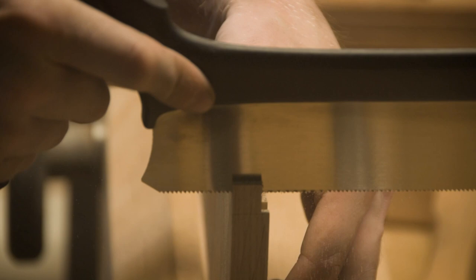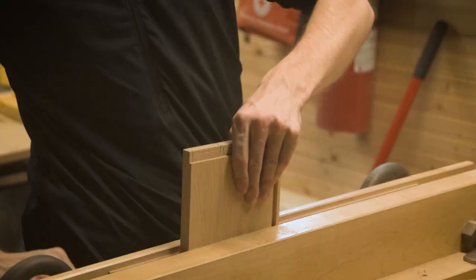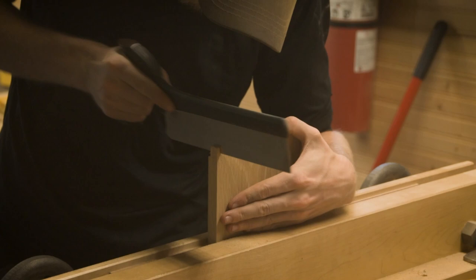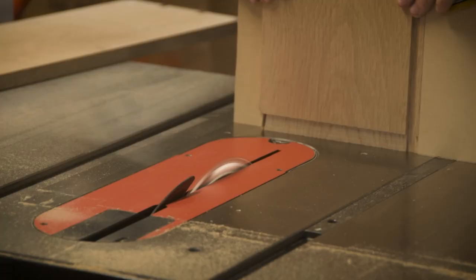And of course on these drawers, everything is going to be dovetail joinery. For the drawer backs, I went with through dovetails because they're simple and fast, and it's really much easier if you go with through dovetails on the backside. And then on the front, I wanted to go with half blind dovetails because I don't like seeing joinery on the front of the drawers in this aspect.